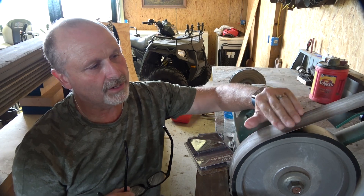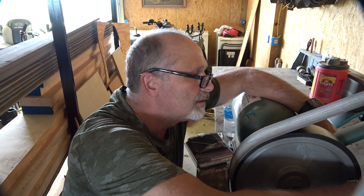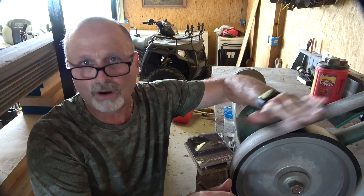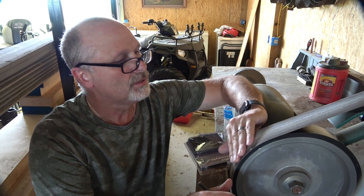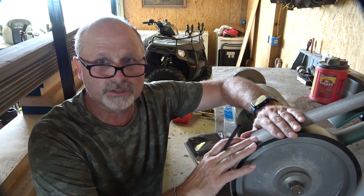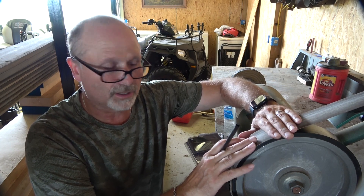The critical thing is this: the belt that's on here was originally a 220 grit, but it's just worn out — there's relatively no grit left on it. That's what I use because you can take away so much material if you're not careful on a big belt sander like this.